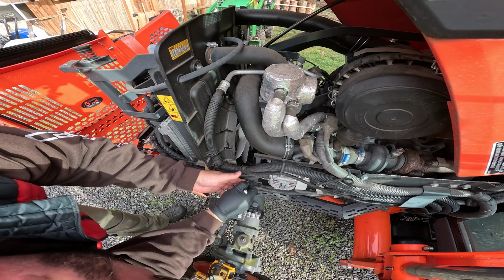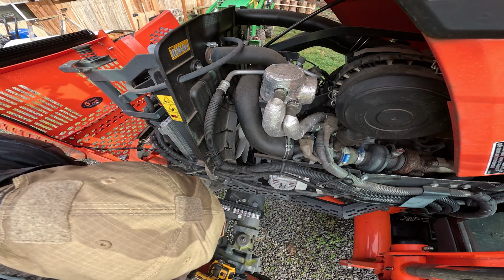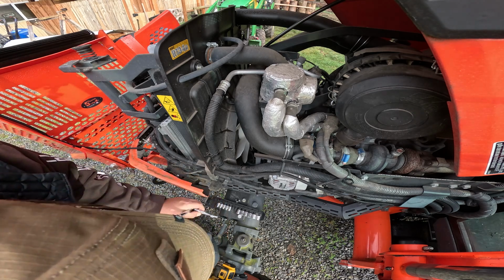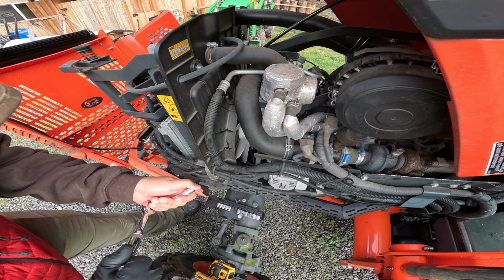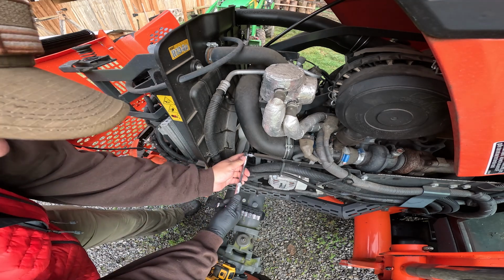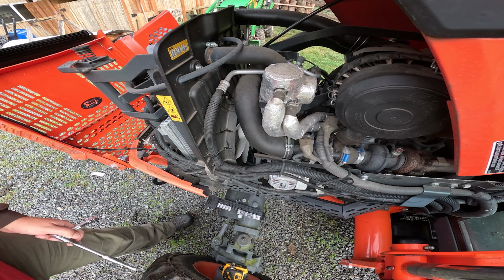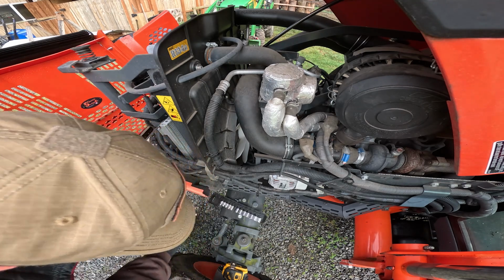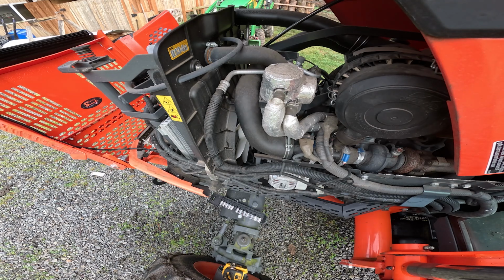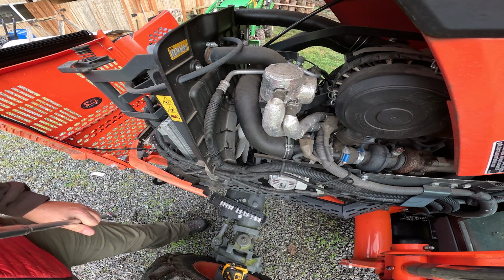But are they both the same? No. They put one that fits the same as the cover and one that's bigger. Two bigger. Assuming I gotta loosen the top and the bottom, but the top looks like it's adjustable, the bottom does not. There's two bolts. So what it actually looks like is the bottom mount is a flexible mount, so I don't want to loosen it. I'm supposed to just flex it with a lever. So we'll see how that goes here. Try the breaker bar, see if we can fish it in there. It says use a lever between the alternator and the block.